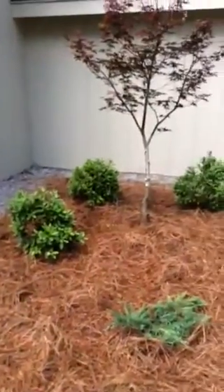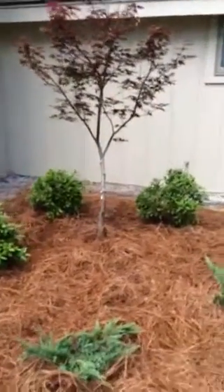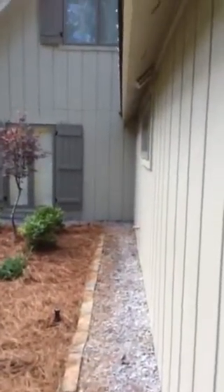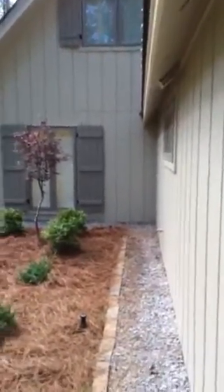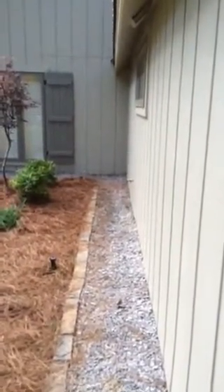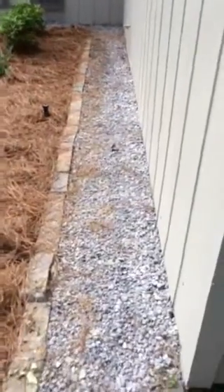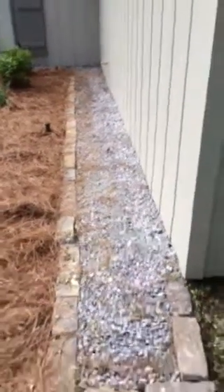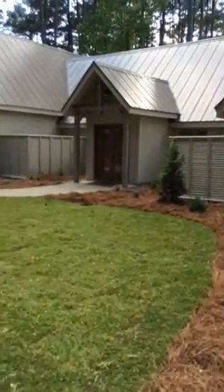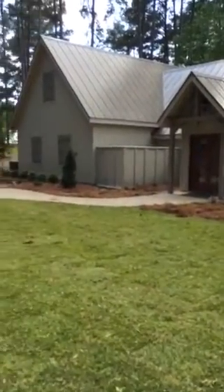I repeated these plants over here that I did on the other side for balance. Behind there is a crushed limestone maintenance strip along the stone border. When the water comes off of this roof, we didn't want gutters here because there are too many trees and leaves to clog them up. So the water will come in, fall down into this limestone, and dissipate — won't wash anything out. This is just the front; the back is not quite finished.